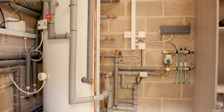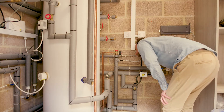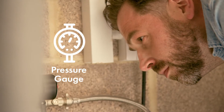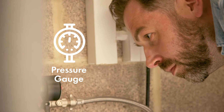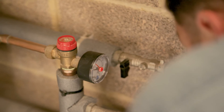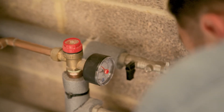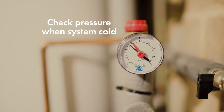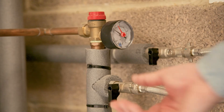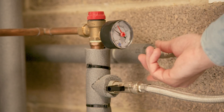All Grant Aerona 3 air source heat pumps must be used as part of a sealed heating system. It's important to routinely check the pressure of this heating system using the pressure gauge. This gauge will be found somewhere on the system, often on the manifold to which the expansion vessel is connected. The pressure is best checked when the system is cold and should be around 0.7 bar for a bungalow or around 1.2 bar for a two-storey house. If it's dropped below this, top it up using the filling link.